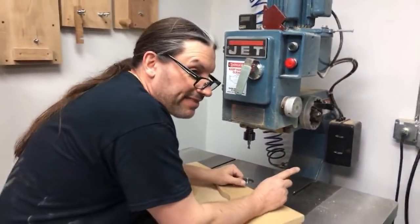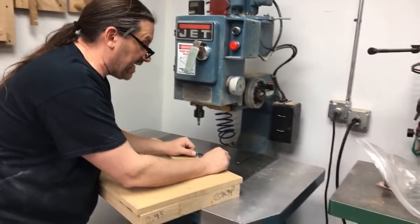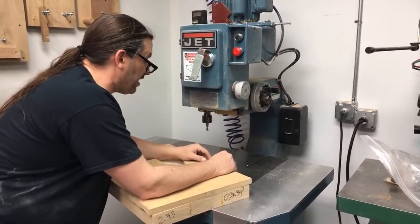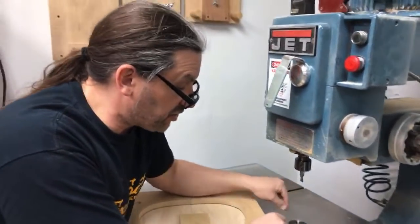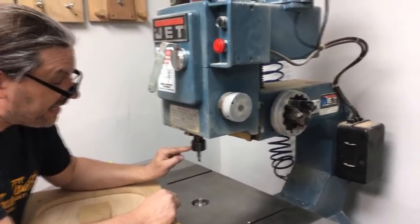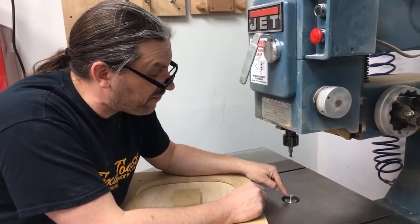Okay, I'm willing to bet that everybody who's watching has a working knowledge of how my beloved pin router works. But just in case people don't, this is the pin router, and it's an overarm router. The reason they call it a pin router is because of this pin right here, which shares two things with the cutting tool. One thing is the center, and the other is the diameter of the cutter. So we have a 1/2 inch cutter in here and a 1/2 inch pin.